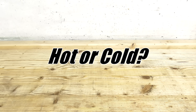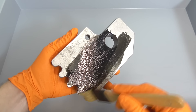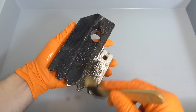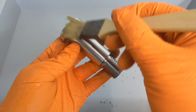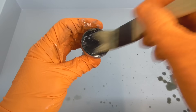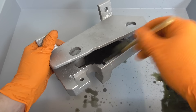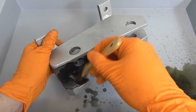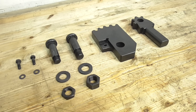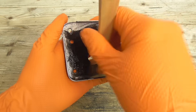How to decide which method is the correct one to use? I'm always preferring hot bluing over cold bluing if it's possible, just because it's a lot faster and easier. The one and only negative point of hot bluing is the heat before the quench. That's why I'm choosing cold bluing if the heat is difficult to achieve or can damage the part — such as on very large parts, where it takes very long and a lot of energy to heat them equally to the needed temperature. I'm also choosing cold bluing on sheet metal as the heat and quench could warp it.